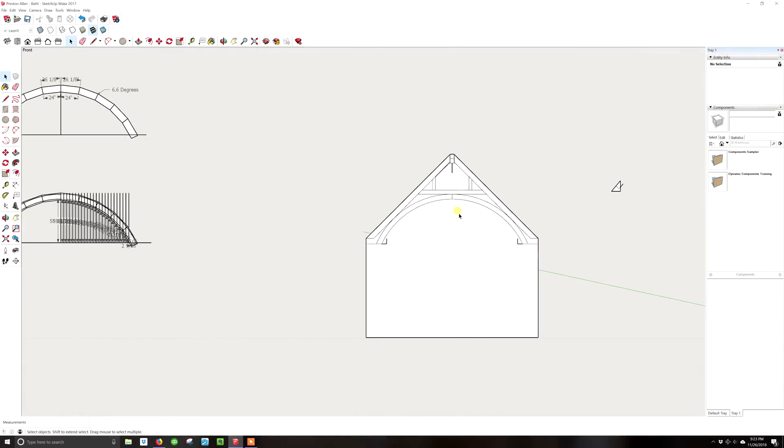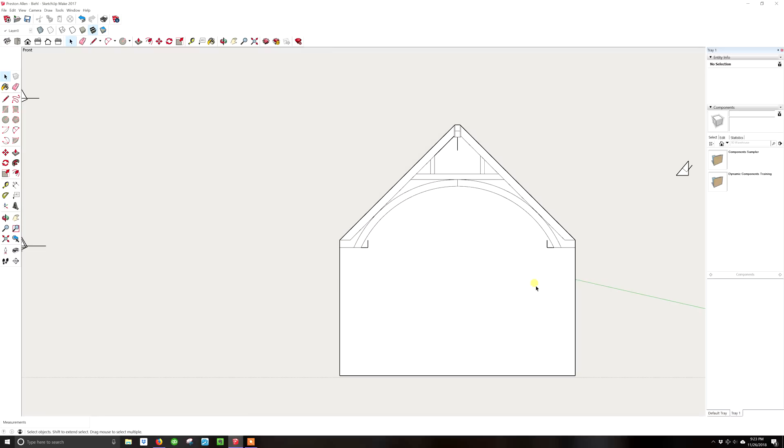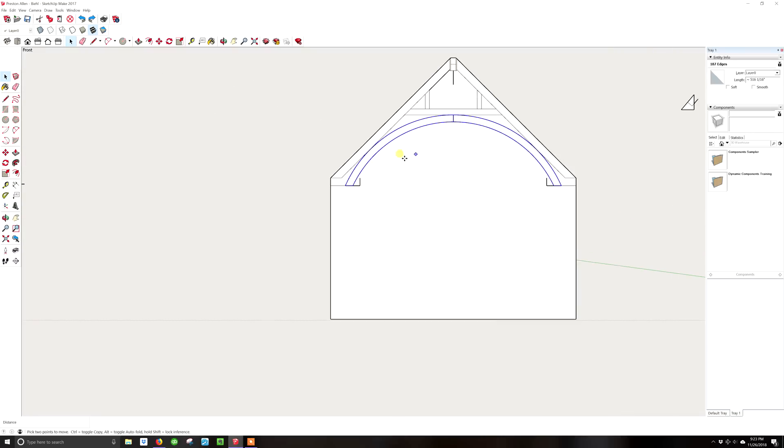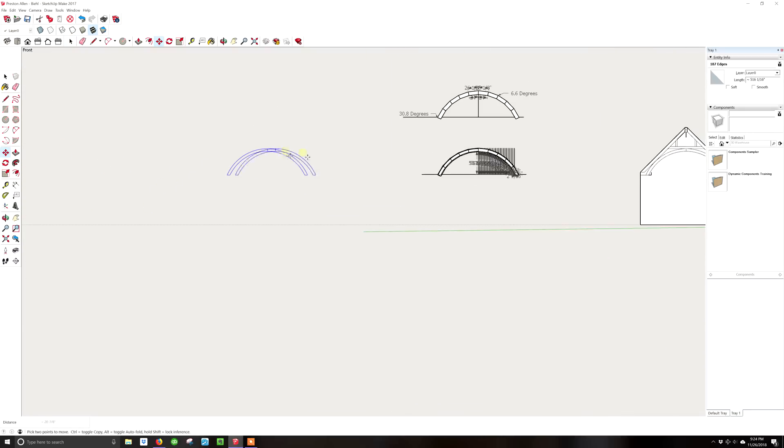The first thing you're going to see in SketchUp is the layout of my room and the design of the truss I'm going to be building. These are pretty close measurements but not perfect — I like to make all my beams long and cut them on site. This arch beam is going to sit on two beams that are sticking out, so I'll make the arch a little bit long so it wraps around nicely, then cut that eight inches or so off on site. Then I'll copy the arch and move it over to the other side of the model.